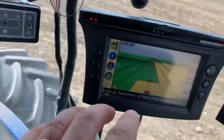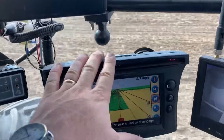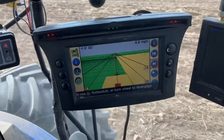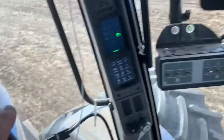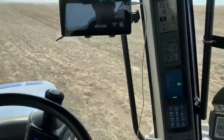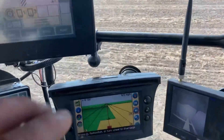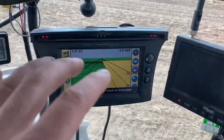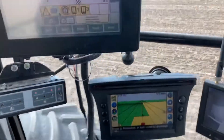Lastly is our GPS system. On a lot of newer tractors you probably won't see an independent system — it's all integrated. Ours is not; this is a 2006 tractor and this system came out around the same time. It has a steering wheel driver motor, and there's a terrain compensating box under the seat to measure the roll and pitch of the tractor. It took us a few years to get it figured out. These guys kind of lost out in our area because the service and support wasn't so great at the time, but it's really a good system.